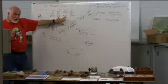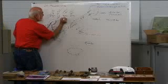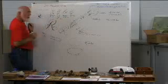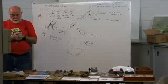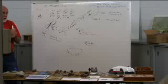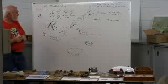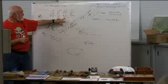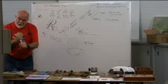And the square, if you're going to buy a square, the one that I passed around, if you notice the etching on that, it was 2.25 millimetre square. And that's a really convenient size for 90% of the engraving you'll do. Because remember, you don't really cut all that deeply. It's really just that extra little bit of width that the 90-degree angle gives you in the square that's important. So it wouldn't matter whether it was 2 mil or 2.5, but it'd be stupid to buy a 5 mil. Now you could buy a 5 mil one, but really that's more for chiselling.